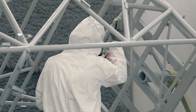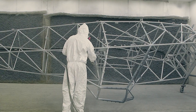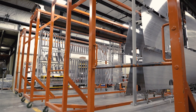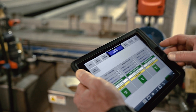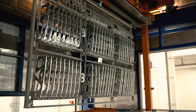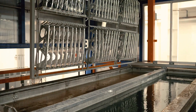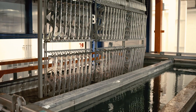The 502B fuselage frame is now inside one of our paint booths, getting its paint. Aluminum skins for the wing, fuselage, and 95% of all aluminum parts in the airplane receive an electro-coated primer in our automated e-coat facility. The e-coat process provides an incredibly uniform primer coat that maximizes paint adhesion and provides a longer-lasting product.